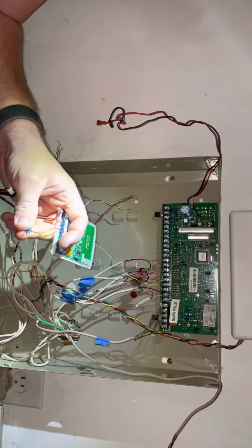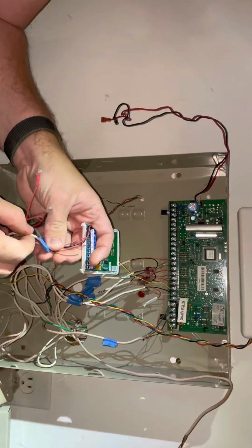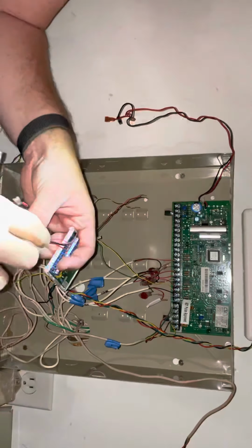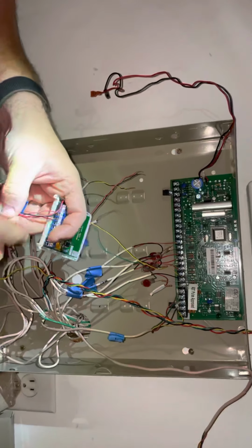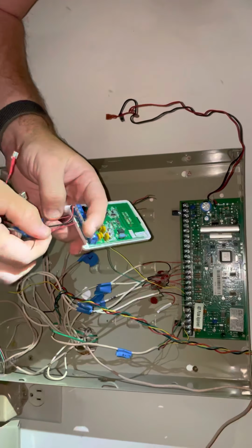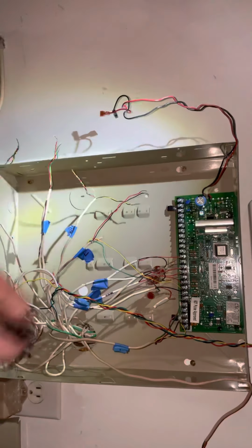So when it's 2 wires like this, so it's 2 wires coming out of one strand, that's either a door or a window. Make sense? It's not actually full wire, it's those stranded wires, the string things. This is the common. I'm going to keep tying all my commons together, and I keep putting all my sensors right in here.